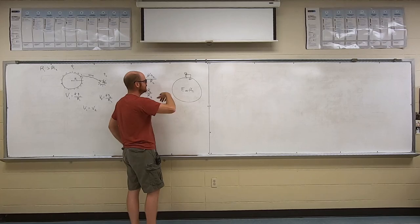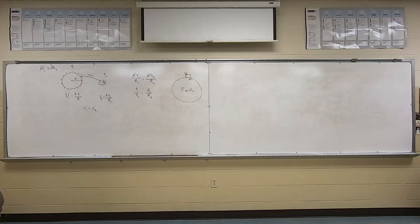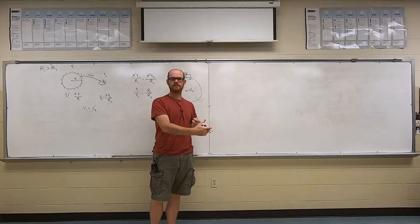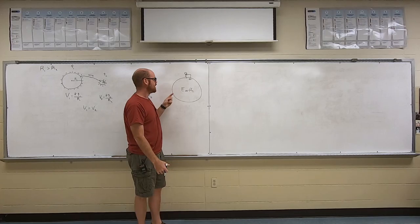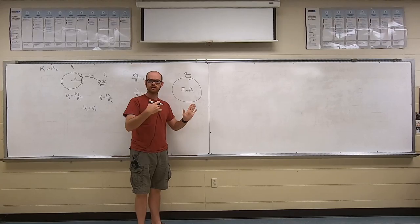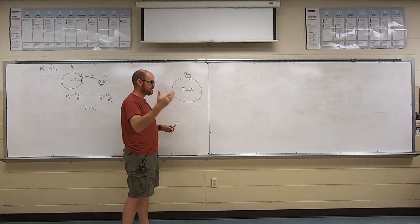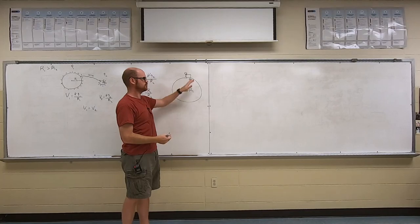If, for example, I was to be stuck with an electric charge, if I was not grounded to something, then the charge has nowhere to flow. There's no path for the charge to take, and so it simply builds up on my body. If I was then to come into contact with something through which the charge would then dissipate, then what happens is I get a shock. Or in that case, the shock represents the electric charge, the current that is actually passing through me at that particular point. A ground connection can save you in that sense because it allows the charge to essentially take a much preferred path. Instead of passing through your body, it actually passes around you and onto something much larger which can take that amount of charge, the Earth in this case.